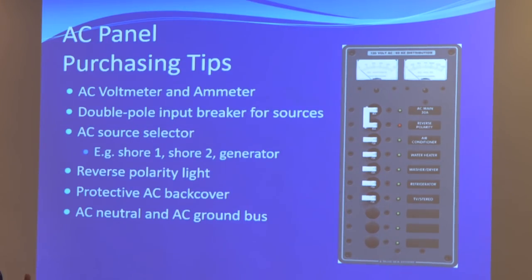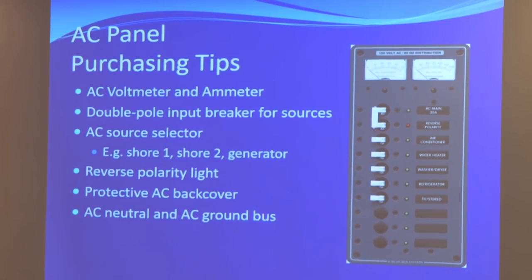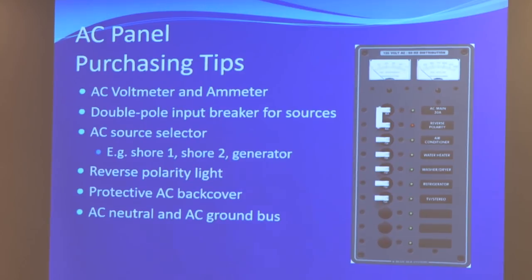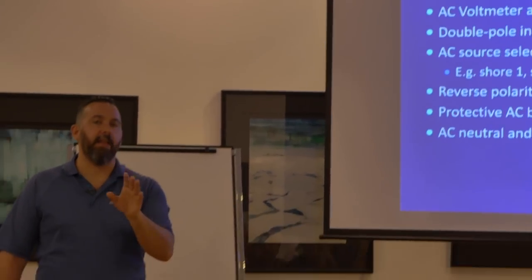If you're buying an AC panel, you want amp monitoring to know how much you draw, because oddly enough a lot of us on AC are going to draw a lot more than what's available — that's a common problem. Running heaters in the winter you might easily pop a 50-amp breaker, no problem. This tells you how much you're drawing so you can start throttling back your loads. It doesn't matter how big the boat is — there are always more AC loads than a generator or shore power can give you. You always have to manage loads on a boat.